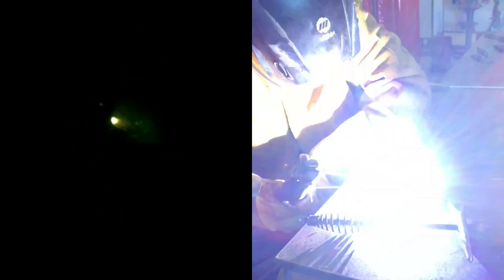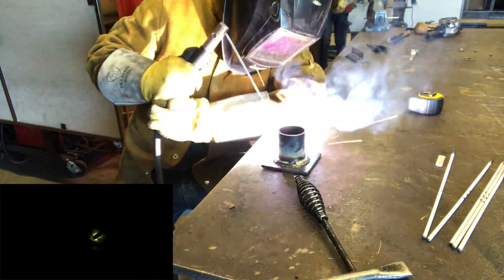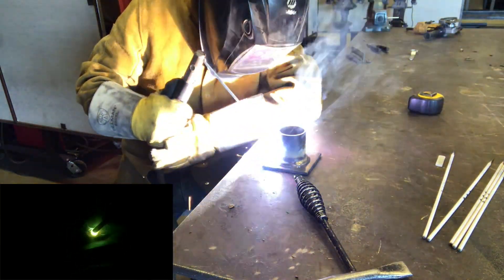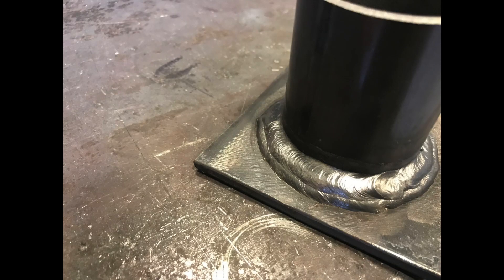Here's what my weld looked like after the first pass, and I continued that approach. The bent rod technique seemed to work out best for me. Remember, welding about a third of the pipe at a time is the best approach. There's nothing different about this compared to a regular fillet weld other than rotating the wrist and working through some awkward positioning — it's something you'll get used to with practice. Here's my completed weld — it's actually pretty nice, follows the pipe well, though definitely not the best pipe to plate I've ever done.